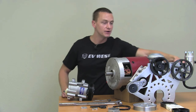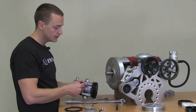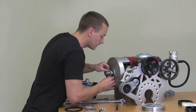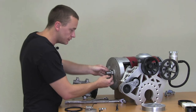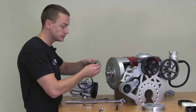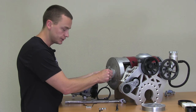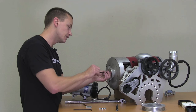You can do a lot with it just as a simple valve change. Here we are at the front of the motor. Our tachometer sensor is actually designed to work with our accessory plate, so we're going to start with that. This is a 3-pulse tachometer wheel, or exciter wheel. You take this down just a little bit past the plane here — there's a set screw on it, you just tighten that up. We've had very, very good luck with this tach sensor; it's worked with a lot of different tachs and a lot of different vehicles. This is the cover plate, which has got our proximity sensor inside. This just bolts right up here to the front — really, really nice clean installation.